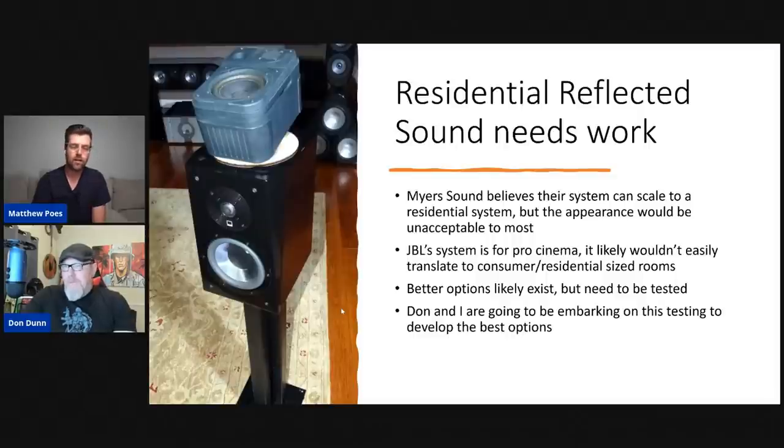Then there's my idea using JBL Synthesis in-ceiling speakers with a very directional horn. This speaker as designed probably wouldn't work as-is — I'm not telling you to go buy these. But this is part of what we need to figure out. We need something that works for the average consumer. For anyone who isn't building a dedicated commercial cinema in their home, they're going to want something where you can hide it. The Meyer Sound system had big speakers on bars hanging down — very industrial. You could imagine creating a custom in-ceiling speaker that's designed to be highly directional, bandwidth limited to operate above 500-600 Hz, reflecting off the screen, with mid-bass modules and subwoofers at screen level — that would give the perception of sound coming from the screen.